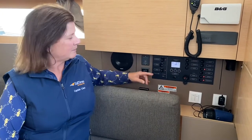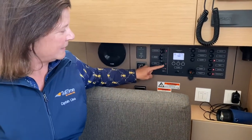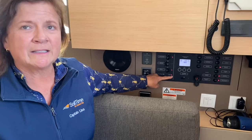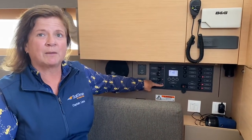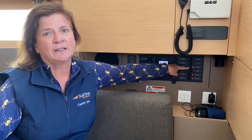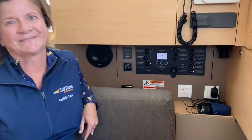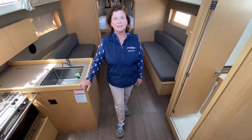In review: make sure that your battery charger is on, make sure the AC power is on and the outlets. If for some reason you can't get the AC power to come on correctly — maybe the whole dock is tripped or there's a power problem locally — turn the refrigerator off to protect the batteries from draining when you leave the boat. Making sure your battery charger is on, making sure the boat is plugged in correctly, and having happy batteries is the best thing you can do for having a great day out on the water.